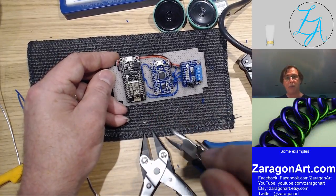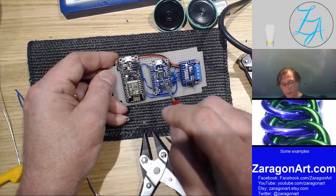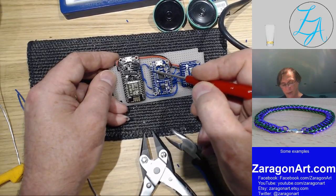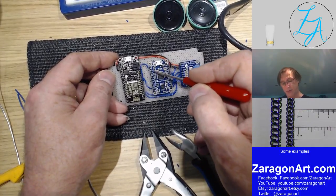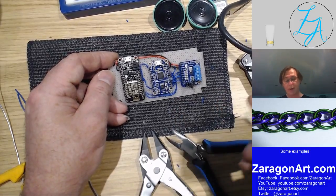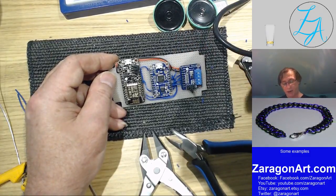If I wanted to wire this to the front doorbell with a physical pair of wires, I would only need this and this, because I wouldn't need this. This has this module here, which is from a company called Adafruit. Down this side here are connections for switches. So if I connected my doorbell wires to one of these, pushing it would tell this chip to play whichever track it is that I've connected it to, so track zero, for example. So I'd only need this and the amplifier, and that would trigger that sound, whatever it was. And I plug this into the computer through a USB connection. It then pretends to be a disk drive, a USB stick, and I just store the track on there.